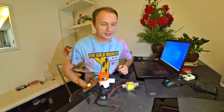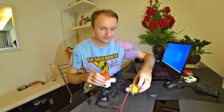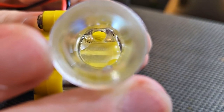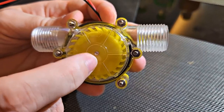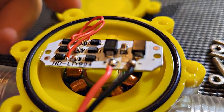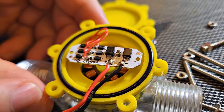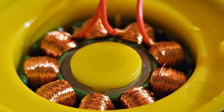We returned home from the forest. Now I'll show you how these mini turbines work and how they can be improved to significantly increase efficiency. We open the smallest turbine — it is arranged quite primitively. There is a small injector with a tiny hole that forms a jet directed to the blades. They spin up and there is a generator inside. We have a diode bridge installed inside — six diodes, a three-phase diode bridge, and two tantalum capacitors to rectify the output. Plus and minus are even signed here, going straight from the three-phase windings.